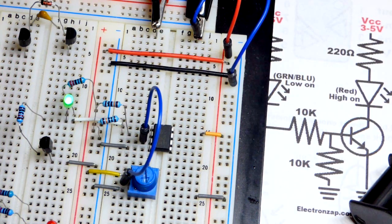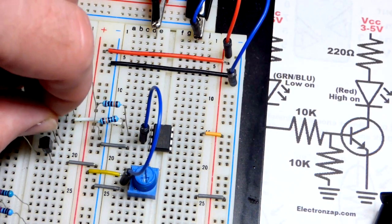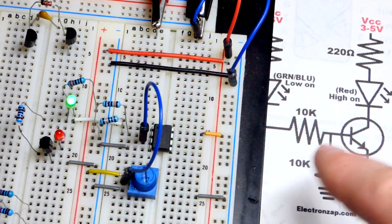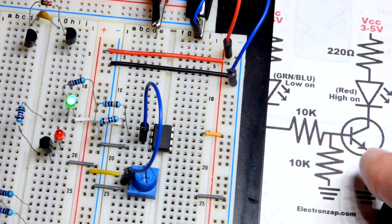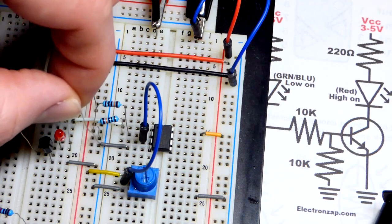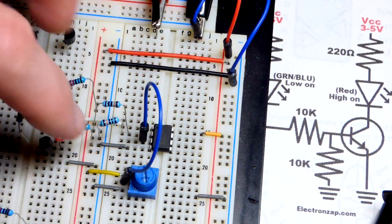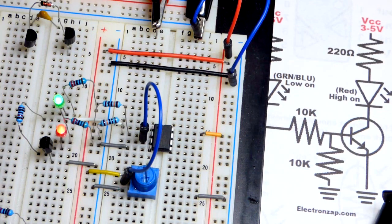It's going to be switching an LED on and off, and we'll put a resistor to the positive rail. Remember: the long lead — the anode of the LED — has to be towards the more positive side. The cathode goes to the collector because that's the more negative side. We're going to use a 220 ohm resistor; at five volts you probably want about 220 ohms or so.